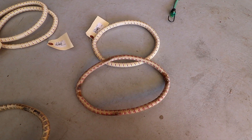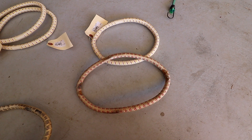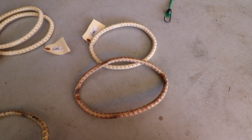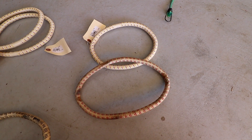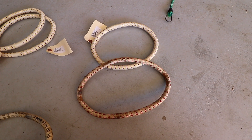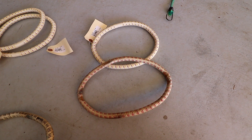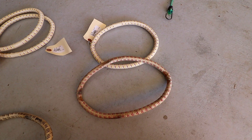Old and new bungees. The one at the bottom is a 90-90 and the one at the top is a 1080 bungee. The 1080 bungee is what's used for a J-4, not a 90-90. So if you've gone and had a look at the LAS Aero website and it said 90-90 for a J-2 or a J-4, that's wrong. Don't use the 90-90 — use the 1080 bungees.